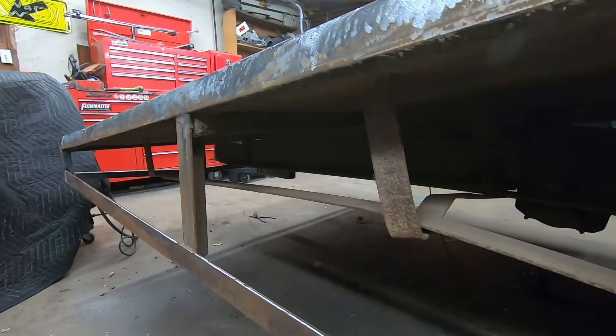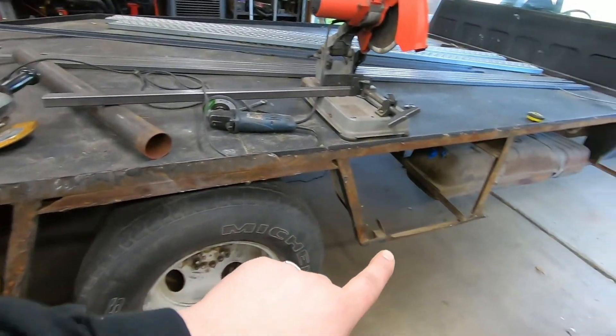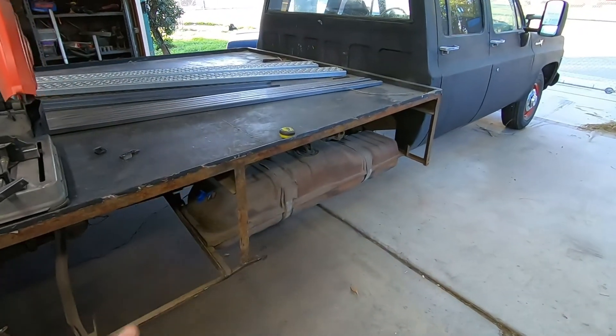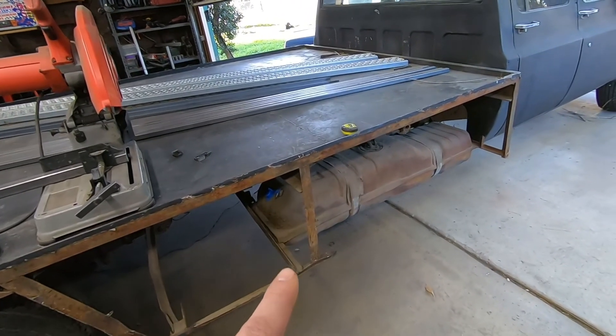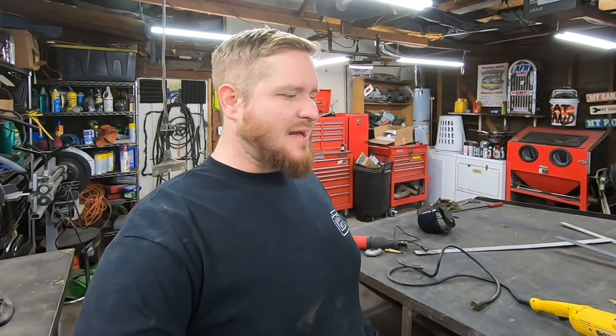It's Thursday and I've got to come up with a plan of attack. There's so much to do you can just kind of pick a spot and start. I've been cutting and grinding above this fuel tank, which is a little uncomfortable. I basically want to run dual fuel tanks - that's a 20-gallon tank which gives me a range of optimistically about 200 miles, so I'm going to need a second tank as an auxiliary. I need to get all this stuff out of here and start cutting material off before I can put new material on.